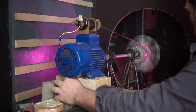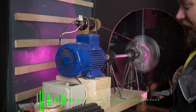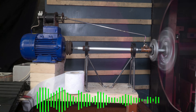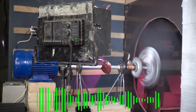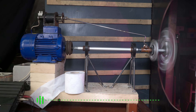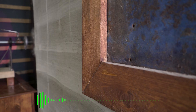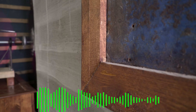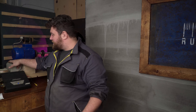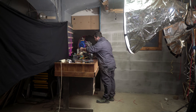Let's start with a very regular rhythm - 1 Hertz, so 60 BPMs - a very common frequency to test if everything is working. Let's turn the motor on. I don't want to push it to full speed because I'm scared that the centrifugal force might make the blades explode. Let's stop here - this is making so much noise. The neighbors are going to think there's an earthquake, but no - it's just this rotary subwoofer.